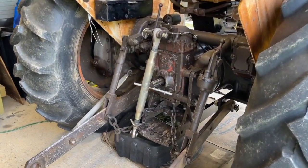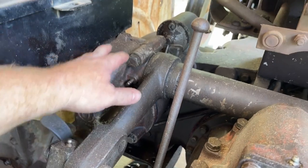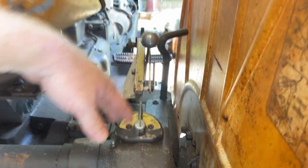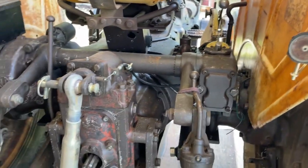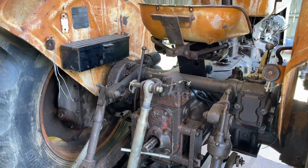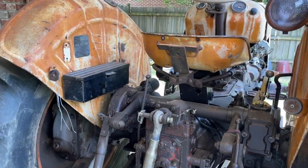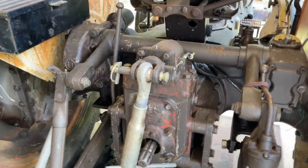For those of you that are new, I have a ton of videos on the refurbishment of the hydraulics on a David Brown 990 tractor. I take off the hydraulic cylinder, redo the seals inside the lift lock, take the valve chest out, redo all the stuff inside there, take the quadrant off and redo it, take the entire ram shaft assembly out — the right-hand ram shaft — and go through the valve chest. So take a look at the content on my channel if you're interested in refurbishing the hydraulics of a Selectomatic system. This applies for most tractors in the Selectomatic range. The Selectomatic system is pretty much identical across all the tractor models.